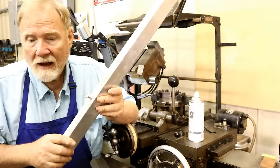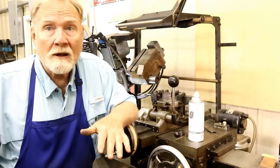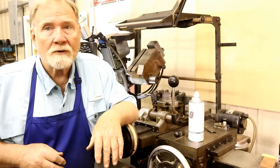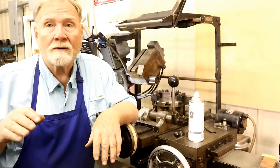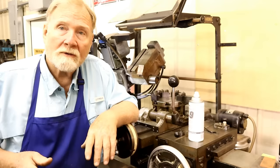And the fact that it really needed some sanding to finish it, or it wouldn't pull. It looked great. You could run your hand across it and it looks good. But for that sand to come out, it had to be better than good. Clark put some graphite in it and a slurry to slick it up, and that worked, but then I spent about 2 hours sanding on the inside of it. Then we got consistent releases all the time. It's more than you think.